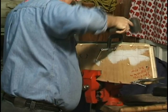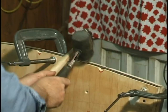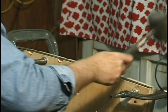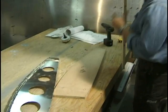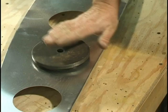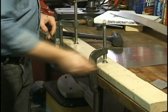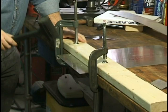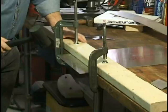Nothing ruins a rib more than having one flange go one way and the other flange go the other way. We are plans builders and have been for a lot of years. We put the former die in, and normally I would tend to use a hydraulic press to bang this down, but you can just come in and start walking on it. You have to go ahead and hit it — it will tend to bend where it needs to bend. With a clamp this way, we'll go back and forth just like we did when we were doing the flanges on the ribs.